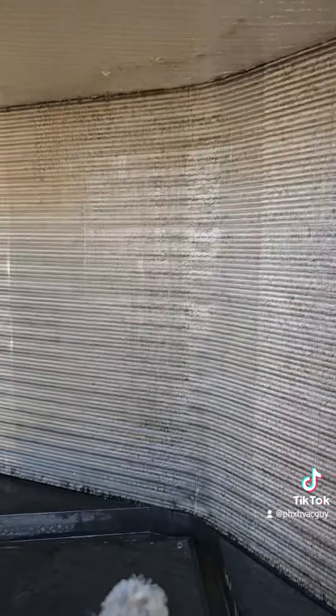If you still have some surface dirt, you can use a wire brush. Just make sure you go up and down, not side to side — that'll damage the fins and will restrict airflow. So just straight down like that. I did the whole coil — there we go. Brand new coil, nice and clean.